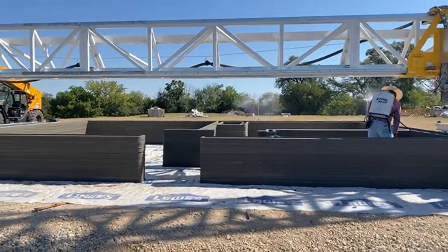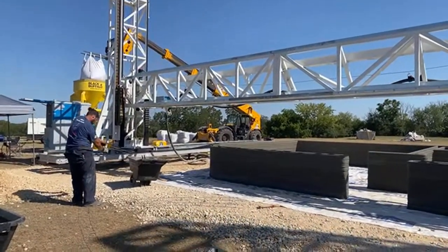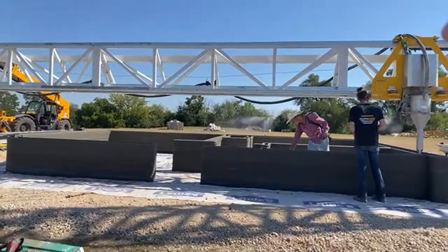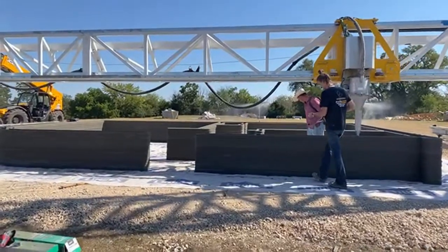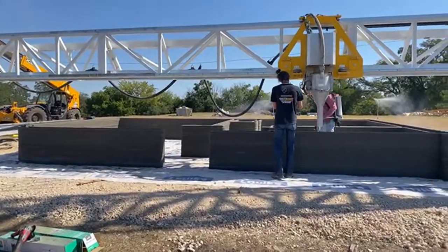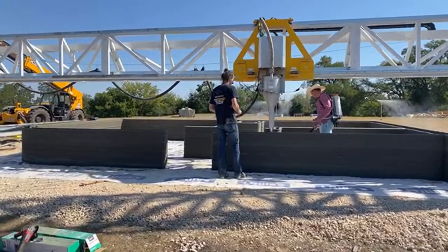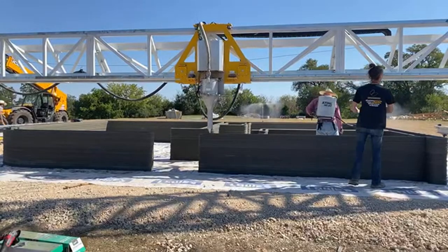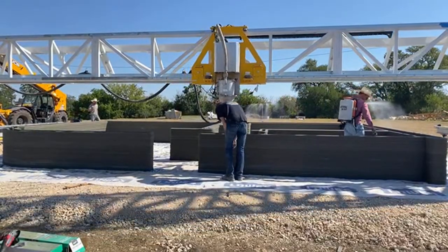I mean, you see the mixer pump system over there. Some people are trying to move to batch plant mixers, which would eliminate the need for somebody at that part. And the hose management was something that somebody was having to carry last time I was here, and now they've adjusted it so it doesn't need any human interaction. Most job sites have someone holding the hose so that it doesn't swing into anything. It's quite heavy, filled with concrete. But I don't like to speculate, so I wouldn't put any kind of time estimate on when they would be able to do a lights out operation.